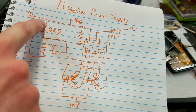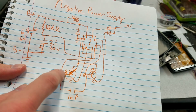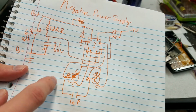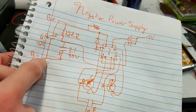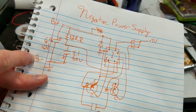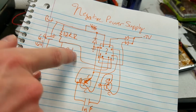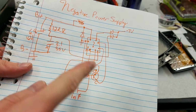So yeah, the battery positive comes in, goes into the coil. I don't really know what to say here because, like I said, I didn't bring out the internal connections here, but you've got two driver transistors. The bases are connected by a 1 nanofarad capacitor. You've also got some filtering over here. So this is the positive and the negative or ground. So this would be the battery voltage right across here. They've got a filter capacitor there. They've got a resistor with a capacitor going into the coil. So how that works, I don't know, but that's the topology of the circuit.